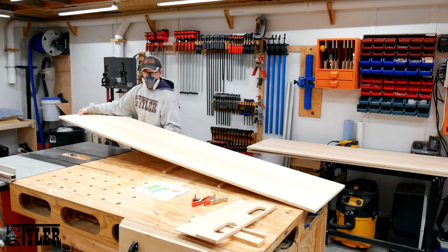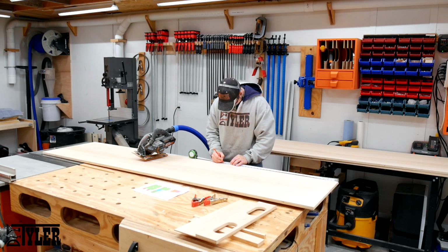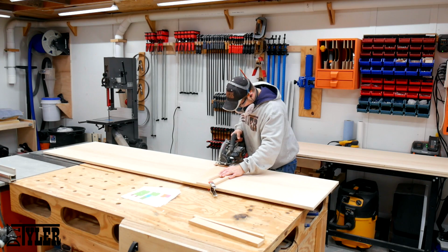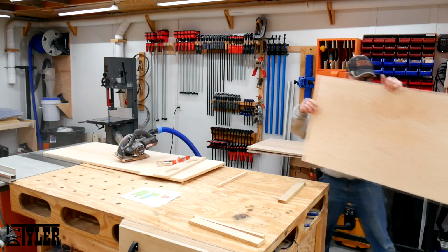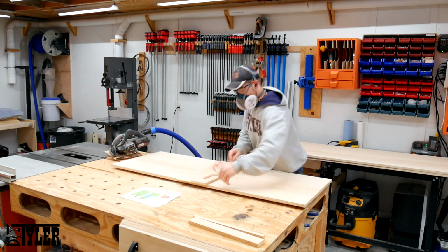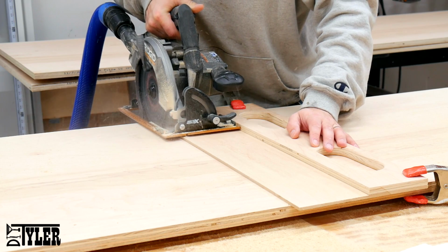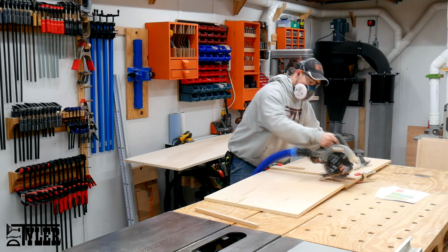Once I had broken down as much as I could on the table saw, it was time to cross-cut those pieces down to more manageable lengths. For the boards that were too long to safely cross-cut on the table saw and too wide to flip on the miter saw, I used my DIY track guides to cross-cut them using a cordless circular saw. I actually recently made a video on making these DIY tracks. You can find a link to that down in the description below or up in the top right-hand corner of your screen.